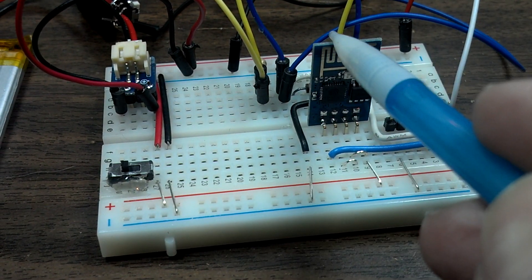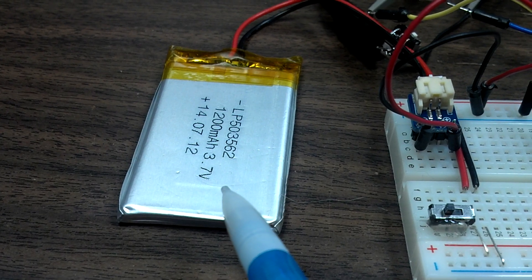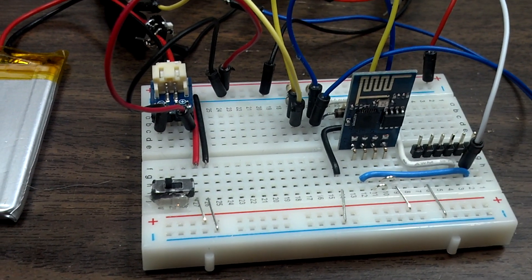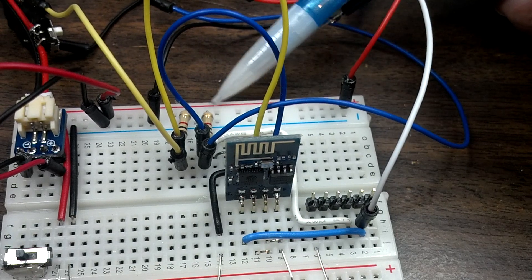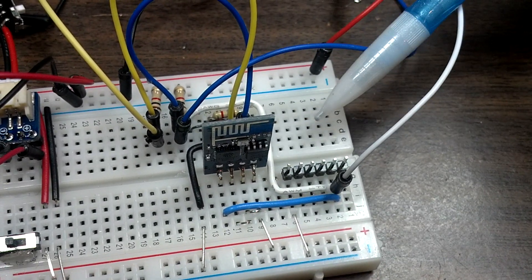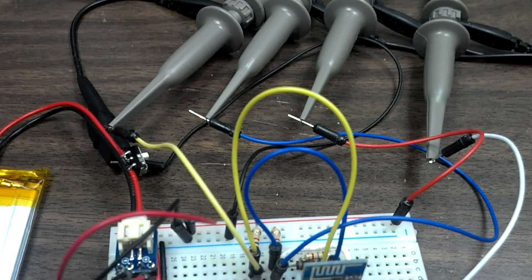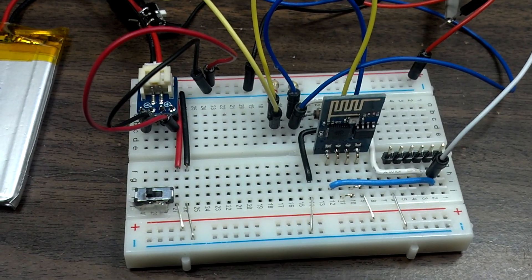Here's the ESP8266. It's just hooked up to be powered by a 3.7V LiPo battery driving it directly — there is no voltage regulator, I'm living dangerously, but it seems to work okay. There's really no other circuit in here other than the pull-up resistors. I have two pull-up resistors pulling up GPIO2 and GPIO0, and then there's two more resistors for level shifting used by the FTDI, which I actually unplugged to make sure it's not affecting the test. The scope probes are connected to various points within the ESP module itself — no transistors, no MOSFETs, no other chips, just the ESP itself.